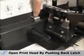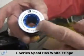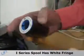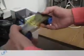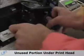Once you've got the cleaning unit in, come over and open the printhead by pushing the latch on the back. Open the printhead and you'll want to put the spool in, which is an I-series ribbon that has the white flange on the back. Putting it in, you'll want to go from top spindle to top spindle with the unused portion going underneath the printhead.